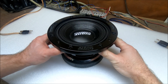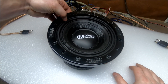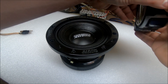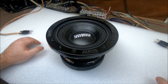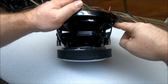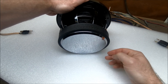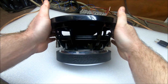Just showing off a few of the different things we're going to do on this model. All new gasket up here, all new cone, surround assembly. So this being our SD model, it is a shallow mount design. We have a total mounting depth of about 4 and 3 quarter inches. This could change on the production model, but it's meant for big bass in a small space. So you got a low mounting depth, we have a solid back plate on the motor, so you can mount this in a very short enclosure. You don't have to worry about any rear clearance, any breathing of any gap vents, any pole vents. This is meant for small sealed enclosures.